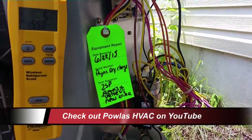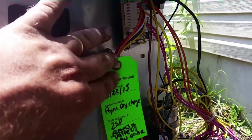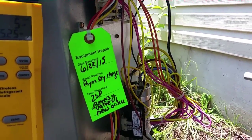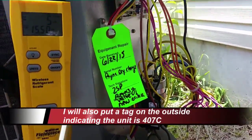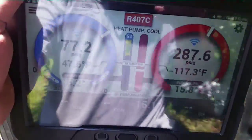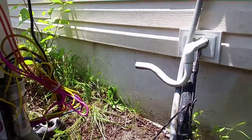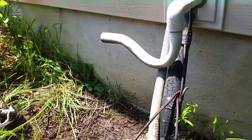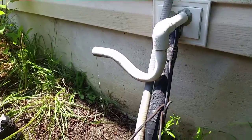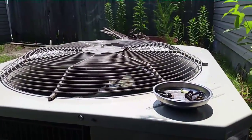I'd like to thank Mike Paulus, Paulus Enterprises, for turning me on to these green tags. I like the tags — inside the cabinet with a zip tie and they're good to go. Can write the date, what unit it was, and more information on the back — we switched it over to R-407C and so on. The unit's running good. Superheat a little low but she's cooling like a champ even with the high humidity inside. We finally got drain water coming out all at once like a river — draining very well, removing humidity from the air. As humidity lowers, our temperature split will go up and comfort will increase. The old Payne will live to fight another day.